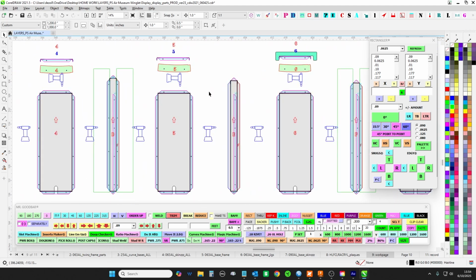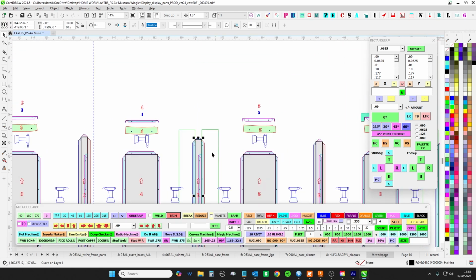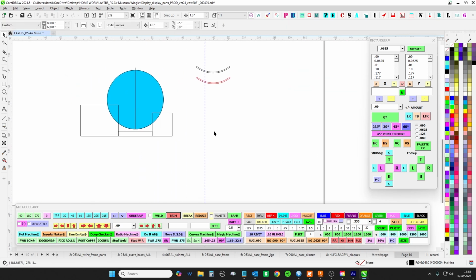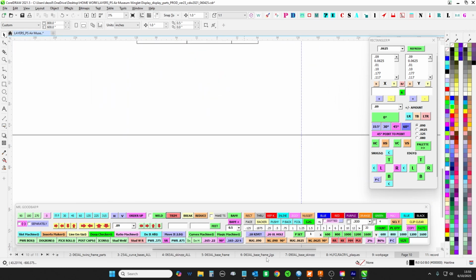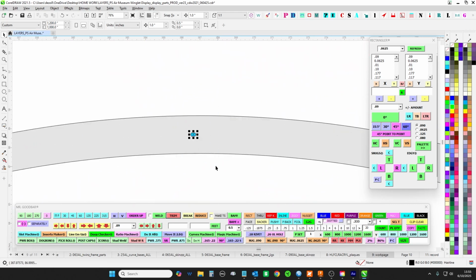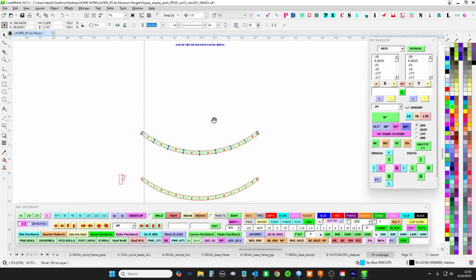And then because at the center point of both arcs, they are equal distance. So this is 32.5 and this is 32.5. And that checks with science, that at the perpendicular point of your circle, these two circles are the same. So at 35 over here and 30 over here, this is 32.5 and this is 32.5, even though the inside circle then goes different from there and there. So I gave you a North Star to navigate by. This one kind of elongated cleco is equidistant in between, and that should set you up for success.